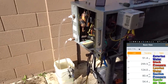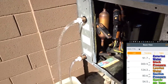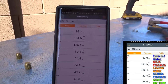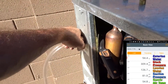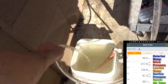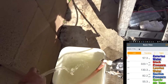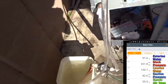I actually found an old submersible pump on a job today. Before I do anything crazy like changing the heat exchanger or adding the other one, I'm just going to try to increase the water flow first. Right now we have 92-degree return water and 125-degree leaving water temperature — definitely warm. That's getting hot — 126, 127. You can't even hold that; it would burn you in a shower. Someone was saying you couldn't do instant hot water with something like this through a shower head, but I think it would spray pretty good.